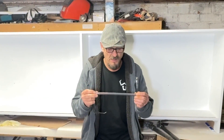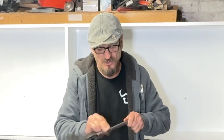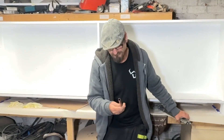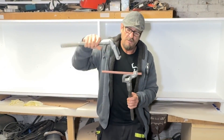Now that's the piece I annealed further. You can see there's a visual difference on it because it's got all that dust on it. And if you actually sand it, it just flakes off — it's just like dirt that sticks to it, it's a process of annealing the copper, and probably also some soot from the gas. But let's see how that performs on the benders.